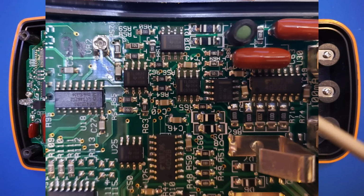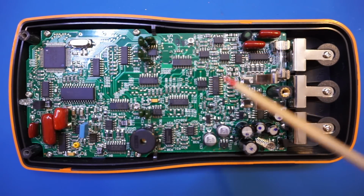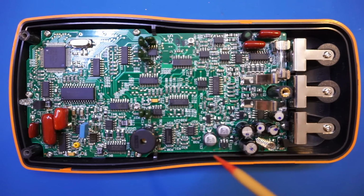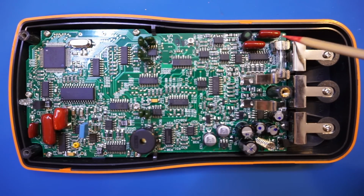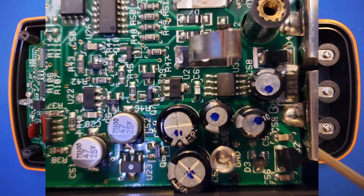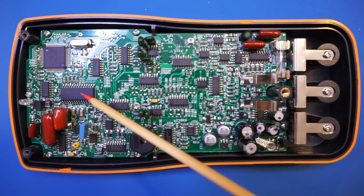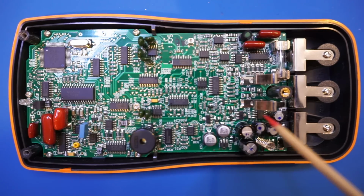Some of these are, for example, 4052s and 4053s, and then we have a bunch of op amps all over the place. And interestingly, what they're using is TL071, 82, and 62. I can see quite a few all over the place. And on the input side, we have this glass fuse here, and we do have a MOV, it looks like, by the look of it. And here, tucked in, is a, you can't see the marking here, but this is a Holtek HT7660, which is a DC-DC converter, which makes sense because the ADC chip here requires both the positive and negative supply voltage. So we have this DC-DC converter tucked in right here.